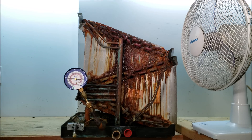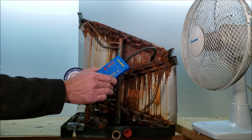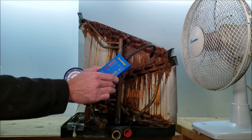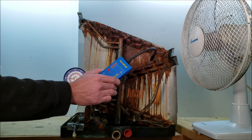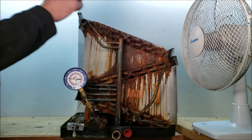If you're checking for a leak at the outdoor condenser, you can go ahead and wet that down before checking. This leads to the question: can you check for a refrigerant leak when it's windy outside? The ultrasonic leak detector is going to pick up ultrasonic noise and not just wind noise, so let's go ahead and test that out with this fan right here.